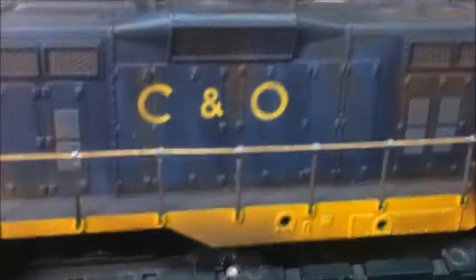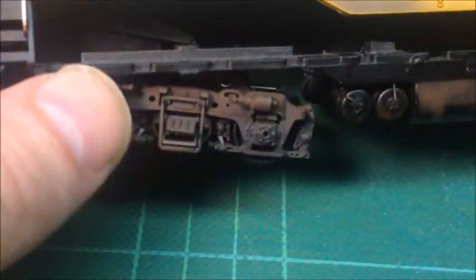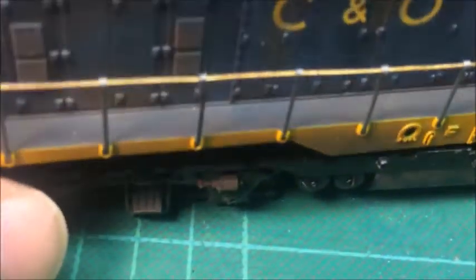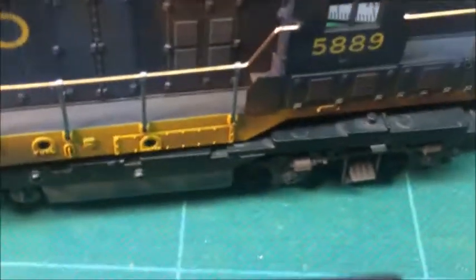Model railroading is a great hobby, but it's also a wonderful learning process. So I've just spent some time on these lower quality, inexpensive models, learning how to do some things. Again, I will ultimately paint the railings, and this will ultimately probably get new Athearn power trucks. The gears on those, while not helical, are a little thinner. The actual gear faces themselves are about a third the width of the old style, so there's a little bit less friction. They seem to run a little bit nicer.